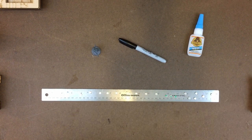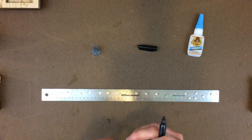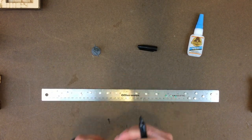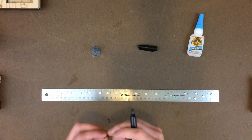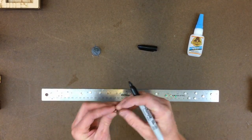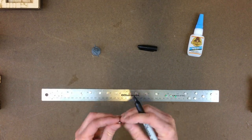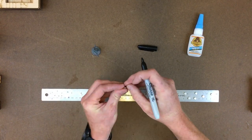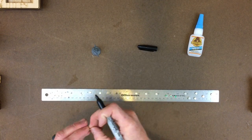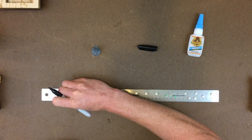What you're going to want to do is lay out the rest of your magnets. You can see here I laid them all out on a magnetic surface — I'm just using a ruler, but you could use a cookie sheet or whatever. Another method is to have them all in a stack and then mark one side. It doesn't matter if it's north or south, just keep it consistent. As I mark each one, I'm laying it out on my surface. The reason I'm not sticking them back to themselves is because the ink actually takes a second to dry from the Sharpie.